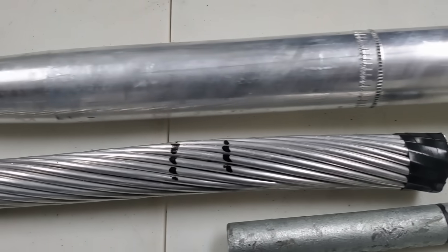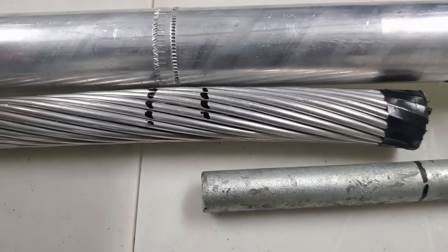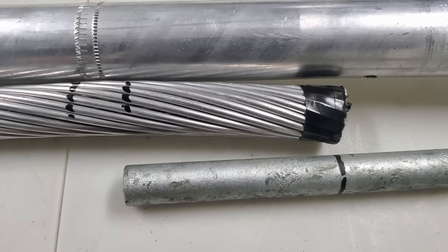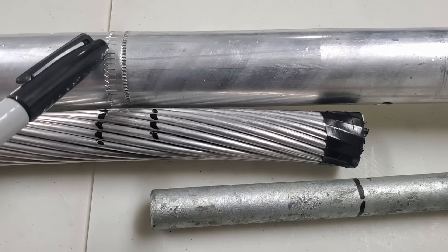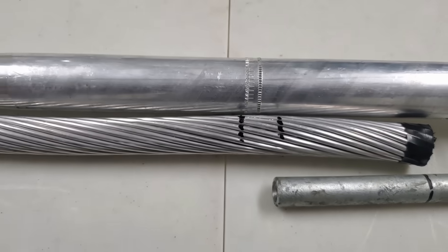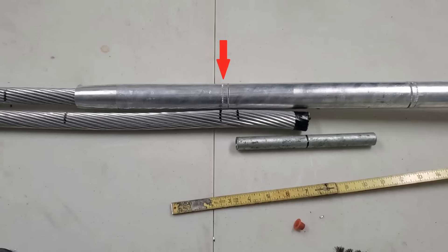You can see I've got two marks on the wire here. There's going to be some cold flow when we start crimping — that first mark is where the sleeve is going to start, and it's pretty much going to reach that second mark once we start crimping. When you start crimping the 556 outer sleeve, you don't want to be crimping over top of the steel portion.